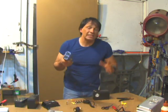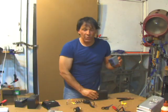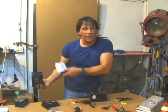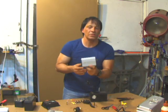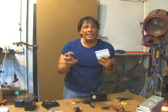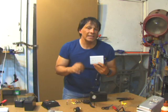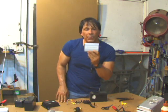Another nice feature is power outages. You have very portable emergency power for a computer, laptop, or LED light. If you have a power outage during the daytime, you could be using this inside any room without running a bunch of extension cords around while another battery is charging outside. It's a good idea to stay about 20% below the inverter's maximum output usage. It'll work for powering LED bulbs, small motors, or laptop computers — anything with a wall jack converter like cell phones. If you have sensitive electronics such as a TV or some alarm clocks that plug directly in, you want to use something called a pure sine wave inverter.